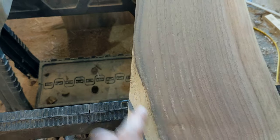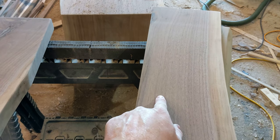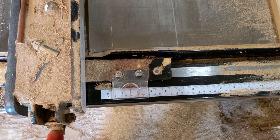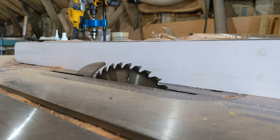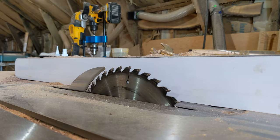For shelves and similar projects I think 120 is more than adequate; on tabletops I like to go up to 150 to get a little bit smoother. Up next I'm going to rip a section that I'm going to actually screw onto the wall. I head over to my table saw, set it at one and a half inches on the dot, and rip every one of these shelves.